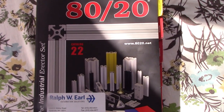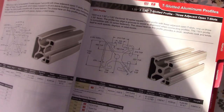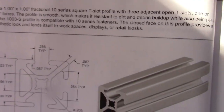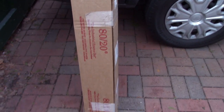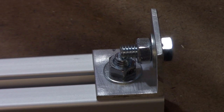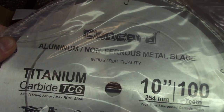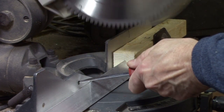Next was shopping in an 8020 catalog — they have various profiles and connectors available, but connectors are very expensive. After weeks of planning and measuring and re-measuring, I settled on the three-sided track extrusion, all pre-cut. Having them do the cutting is usually cheaper than buying full lengths and cutting yourself due to waste. To avoid expensive 8020 connectors, I bought aluminum angle at the home store and made my own. I needed a non-ferrous metal cutting blade to cut the aluminum, and once I set up a stop in the saw I chopped up these L-brackets.